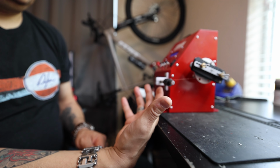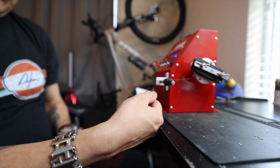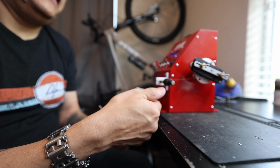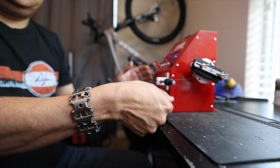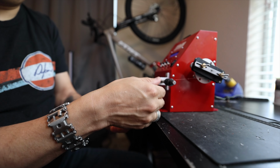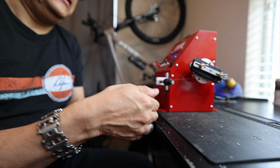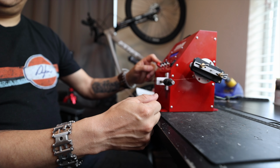And then you want to make sure that you put your hand underneath it, because remember that wire is coming up and going back and forth like this, so it sort of keeps it within your hand. You hold it at a 45-degree angle or so, because if you're going underneath too far, then that pulls it tight and it causes a problem. Of course, if you lift up, then it can go all over the place, right? So it has to stay within those guides. So 45 degrees, just some tension, and this is the gas, right?